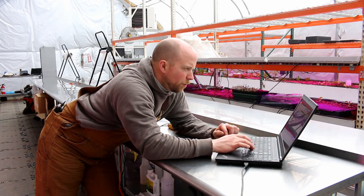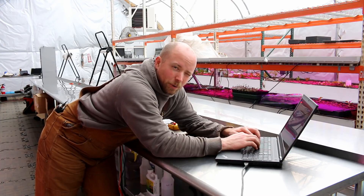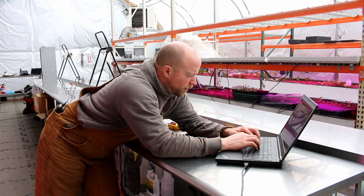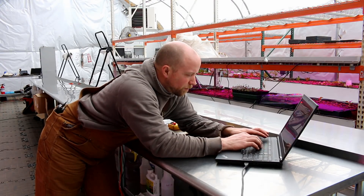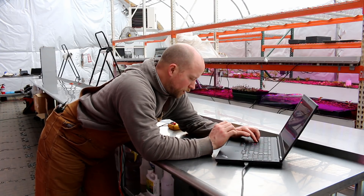Updating the equation. The zero intercept is when it reads 0 and equals 0%, so b equals 0. Slope is rise over run times the value. If it reads 1024 and it's supposed to equal 100%, then y equals 100 when x equals 1024. So y divided by x - that's 100 divided by 1024.